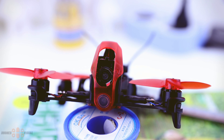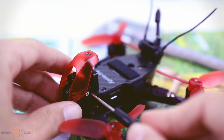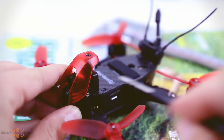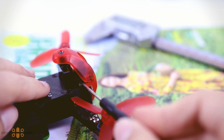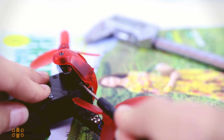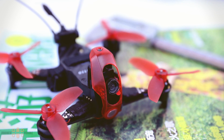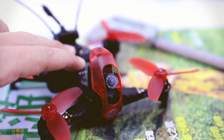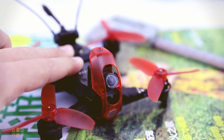In the front you can see the tiny LED light and the 600 TVL camera that supports PAL and NTSC and can work from 5 to 12 volts according to the manual. Protecting the LED is a red plastic cover, which is really nice and can save the day if you crash. To adjust the camera angle, loosen the two screws on each side — once you start loosening the second screw the camera will already start moving. After placing it in the position you want, tighten the screws right away, otherwise the camera will return to its previous position.